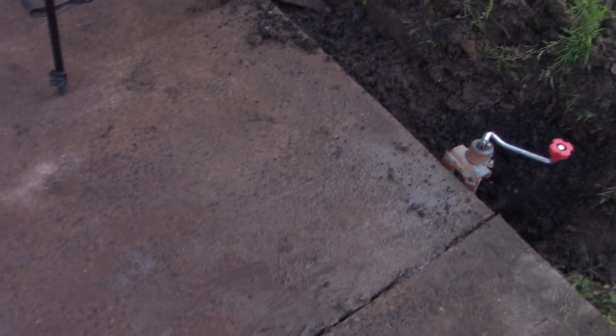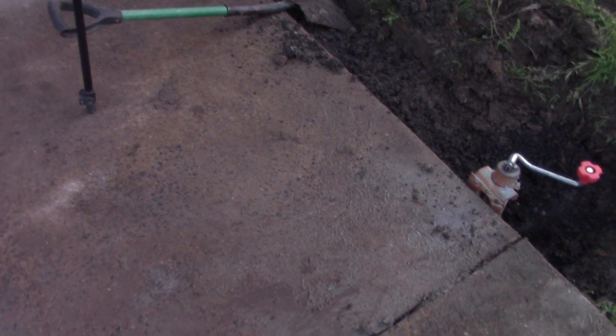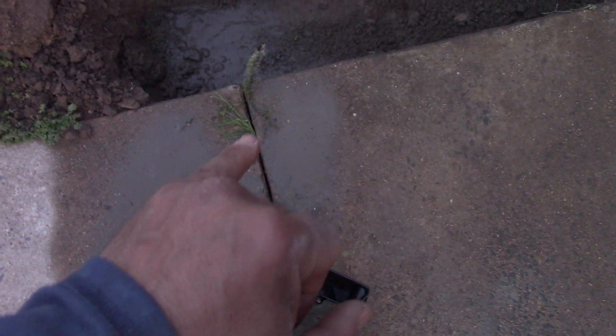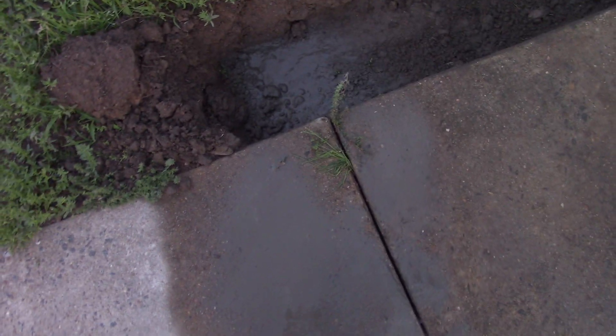You can just do it this way — dig under there, put a footer under here, put concrete under there, and make sure you point it up real tight to the underside to act like a ledge. You really need to take care of that if you're going to do this technique. I addressed it over here, and this side was already addressed by luck — when I lifted the other side up, the reaction took care of this one. That's kind of cool. I cleaned up the cutter, so hopefully this is helpful.